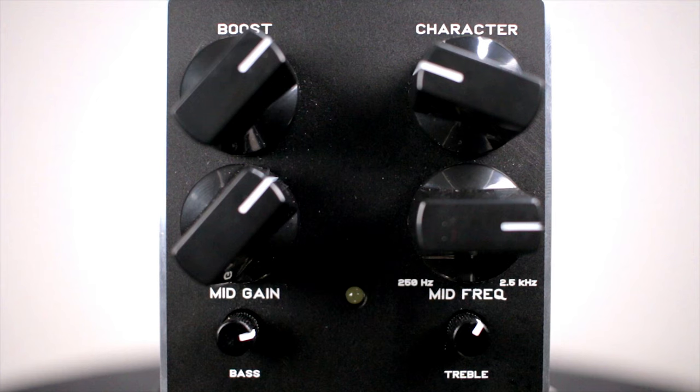And finally below that, you have your 2 knobs for bass and treble. For bass, this lets you cut or add 20 decibels at 80 Hz. And then with treble, this lets you adjust those 20 decibels at 5 kHz. So not only does this pedal really sound fantastic just on its own, where you can really make it into part of your fly rig that can just be get up, go, get the perfect sound you're looking for, especially if you're more of a clean bassist as well.